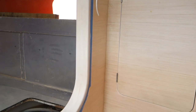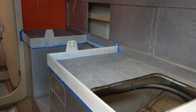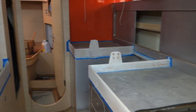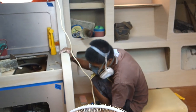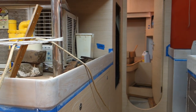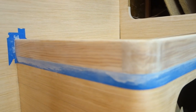The varnishers have been hard at work on the solid wood down below in the saloon and in the galley. Jamie and I started this earlier in the project — painting it white, sanding it off, then varnishing it. We didn't find it particularly easy and some results were a little patchy. So we passed it on to the varnishers, who have sanded it right back, put a little bit of white paint on it, and are now sanding the white paint back. Underneath is the veneer which has had several layers of varnish; above is the wood which has been painted and sanded, not yet varnished.